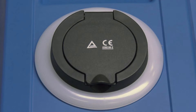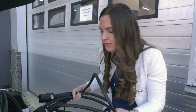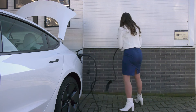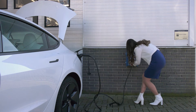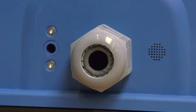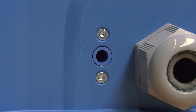Within a configurable light ring there's a Type 2 electric vehicle charging plug. This is the standard European charging cable connector type and is fully compatible with both single and three-phase electricity supplies. On the base of the station there is a nylon cable gland for the incoming power cable of up to 19 millimeters in diameter. There are also venting holes as well as a hole for draining any water from inside the connector.